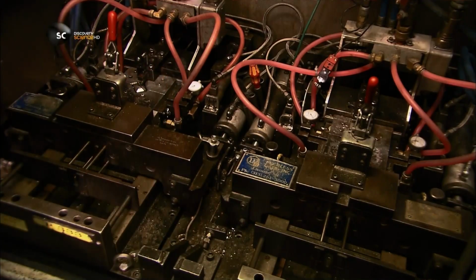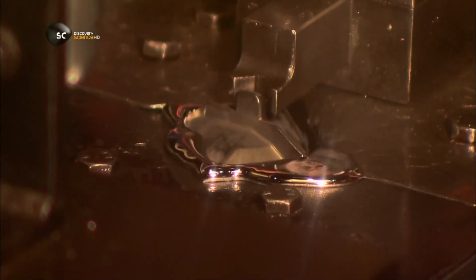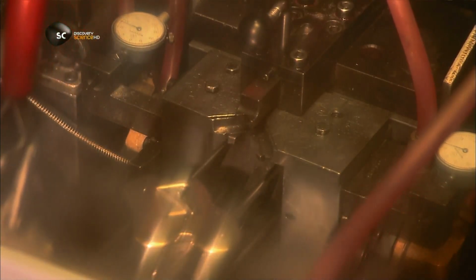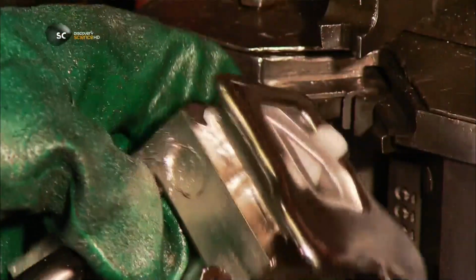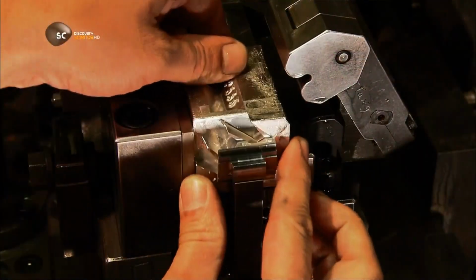The casting machine will encase the aerofoil in a matrix, a coating that protects the aerofoil during work on the dovetail. They mold the matrix from liquid tin and bismuth. It solidifies into a metal cast around the aerofoil. The future dovetail sticks out at the end.